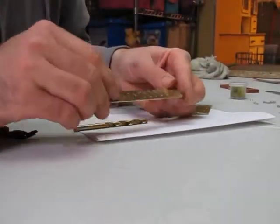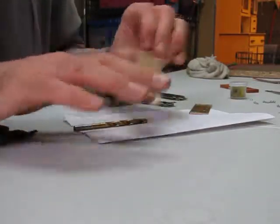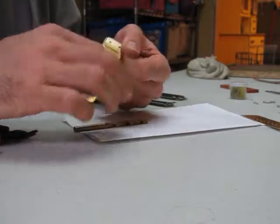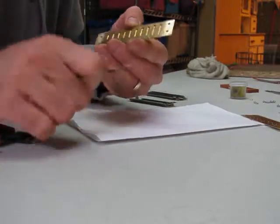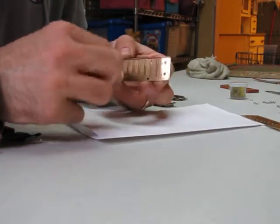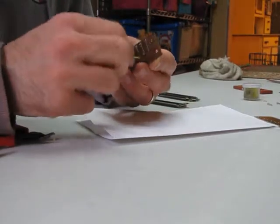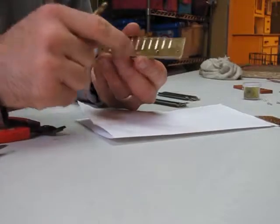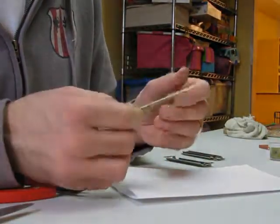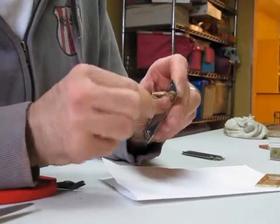To get back to it: we have the draw plate — the holes have been tapped, it's flat sanded, and the corners are rounded. I'd like to rinse this off before I use it. The blow plate has been drilled through and through, and then we drilled clearance holes that are a bit larger. They have burrs — I can just pick a small one off with my finger. For a bigger one, I got a large drill bit and I'll gently go through there to clear out that side. This is for aesthetics on the outside, and for air tightness on the side that's going to be in contact with the comb. I'm going to rinse this off and get rid of the burrs on the cover plate.